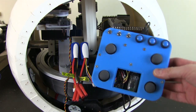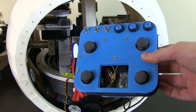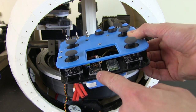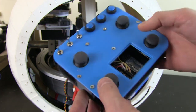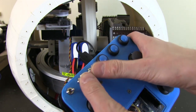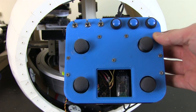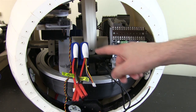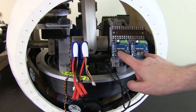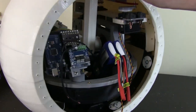Here's what we had from last time. I built this Bluetooth remote, using Bluetooth so I can write a smartphone app in the future. I've got an Arduino Pro Mini and the Bluetooth transmitter, four joysticks so I've got enough for all the axes, various switches, and I demonstrated the comms chucking that out to a USB to serial converter. In the droid itself we've got batteries, two motor drivers on this side, and a power distribution strip.